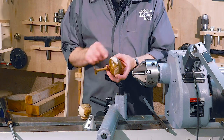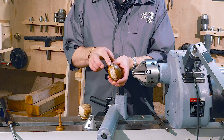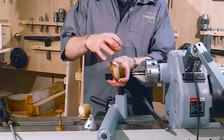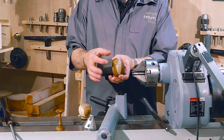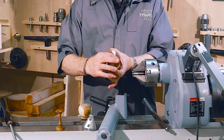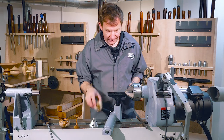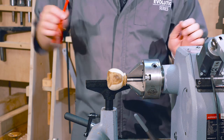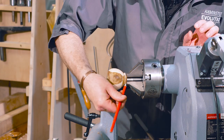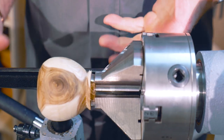With our box design, we've got quite a bulbous shape round here and we've got our lid that can come off. Our shape round here — as much as we can extend it — can be really good at this stage. It helps build the shape while we're turning and gives us an idea of the wall thickness and measurement. We've deliberately taken one of the jaws off the chuck so we've got this open gap. Now hopefully if you can see into there, how this grips — we've got the little dovetail gripping in there nice and firm.